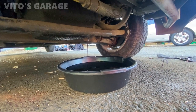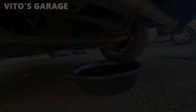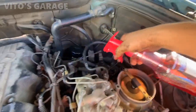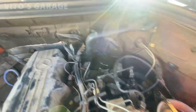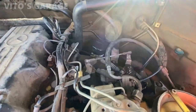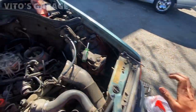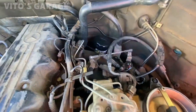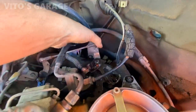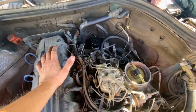I'm gonna let it finish draining and in the meantime I'll start cleaning everything up top and lubricating all the linkages. I started lubricating a bunch of these bushings, joints, and everything — the linkage moves a lot nicer now. I wasn't able to remove a couple of ball joints because they're really stiff, so I'll have to wait till I get back to Washington and use a couple other tools. But I was able to remove the bottom cable, lubricated it, put grease on it, and a bunch of these bushings — everything moves amazingly now.